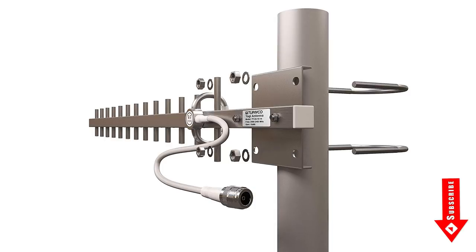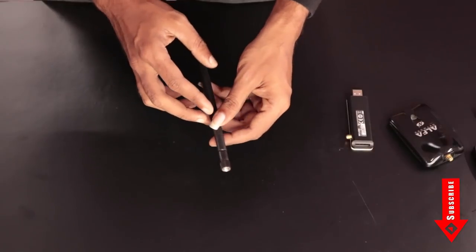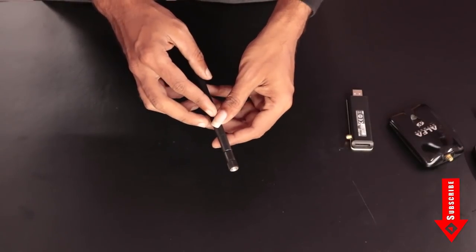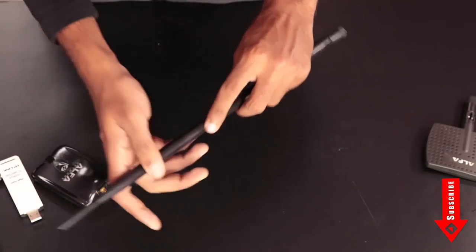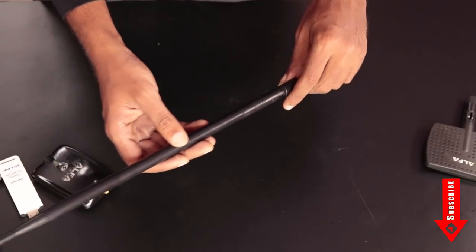Next, we will talk about the most commonly used Wi-Fi antennas. The first one is the dipole antenna. The dipole Wi-Fi antenna is the simplest antenna that can be used for wireless communication. It is also known as a half-wave dipole antenna because its length is half the wavelength. It consists of two identical metal rods which are separately fed using two different wires or feed lines. These antennas are commonly used for indoor purposes such as Wi-Fi routers, USB Wi-Fi adapters, televisions, etc.